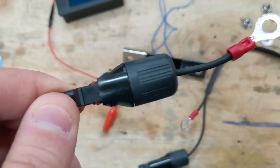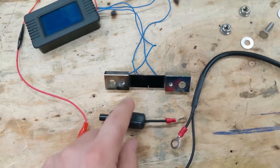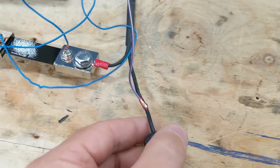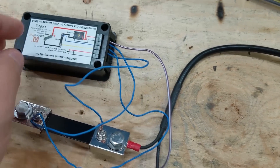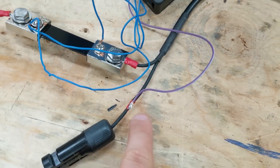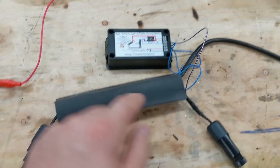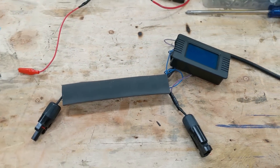This actually says positive on the plug right there, but that plugs into the negative side of the solar panel, so it's actually the negative part. And that's why I put the ring terminals on here — I have the negative side hooked up through the shunt. On the positive side I did not cut the wire; I just soldered the positive wire directly to it so the meter can read voltage. Now I'll put a little tape over this and slip the big piece of heat shrink over the shunt. And we are ready to rock and roll. Let's take this outside and set it up in the sun.